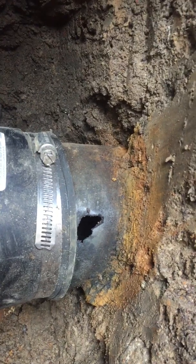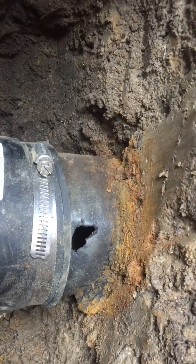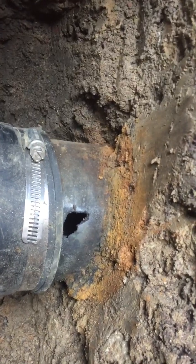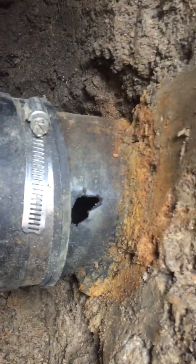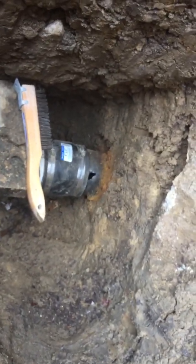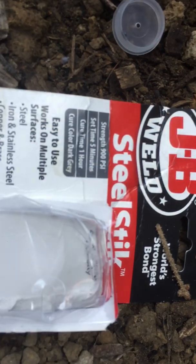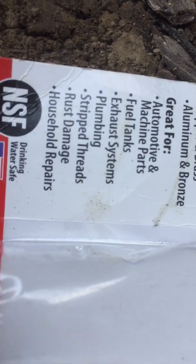This pipe is at least 80 to 100 years old, so the cast iron is getting a little brittle. Rather than make the project of drilling through the home and reinstalling a cast iron lead — of course, if that's what's necessary we'll have to do it — but for now this should be fine, especially since the damage is on the top portion of the pipe. We're going to use some JB Weld.